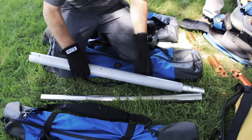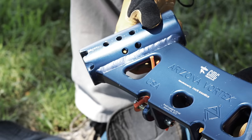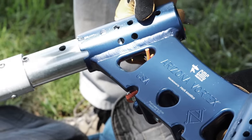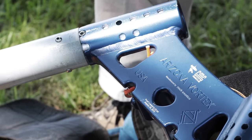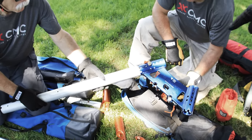The next phase of our construction of our tripod is to put the legs in. We are going to start by placing an outer leg into the head of the Vortex. You will notice at the head of the Vortex there are three indexing slots, and on the leg there is an indexing pin. Sliding that pin into the slot lines up a hole at any one of three different positions. That three-eighths inch pin is rated at 18,000 pounds.